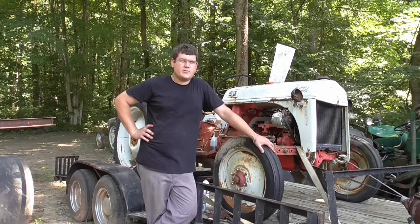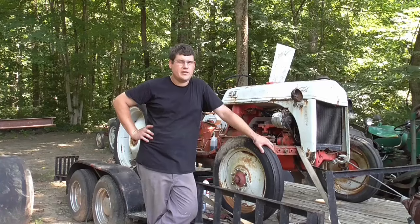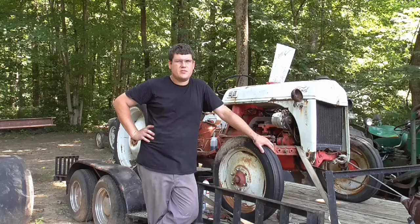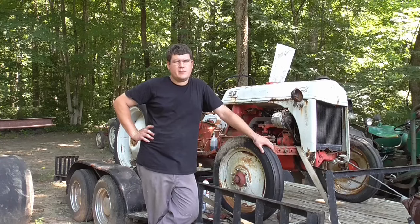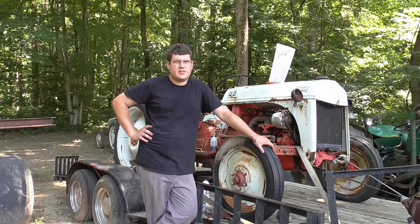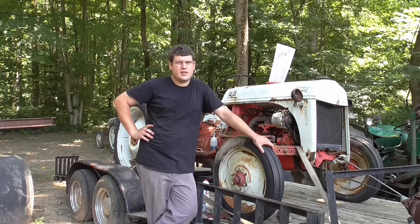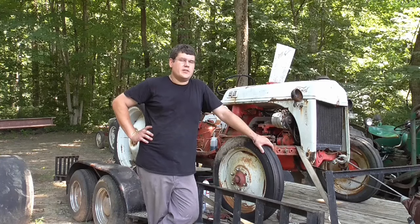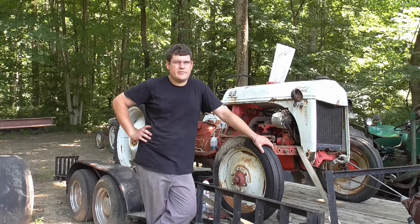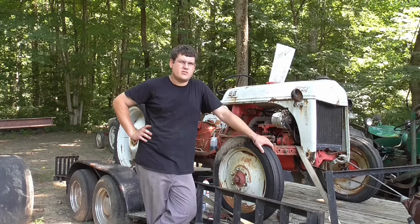Alright, well after 7 plus years of this thing sitting in the field with the carburetor off of it and those intake holes just wide open and the exhaust, this thing actually started. I'm not going to drive it today. This will probably be about it for this video today, but I'm going to get some more parts, get the carburetor worked on. I might just take it off that 9N over there and use it. But for right now, I'm going to have to get that swapped around, run a gas line. I'm going to get me a fuel bowl on order and maybe clean that gas tank out a little bit, just make sure there's no junk in it.